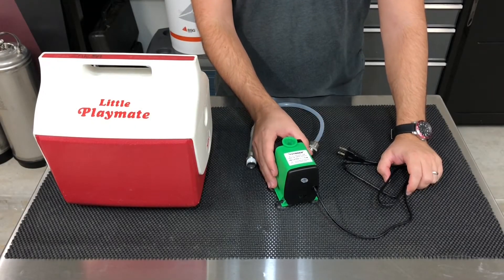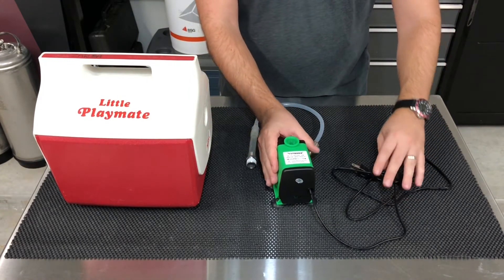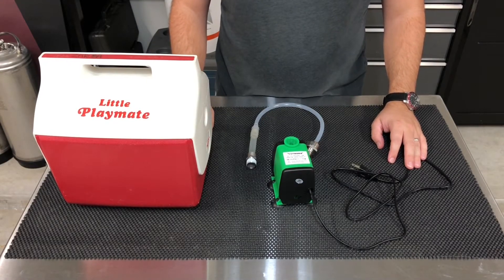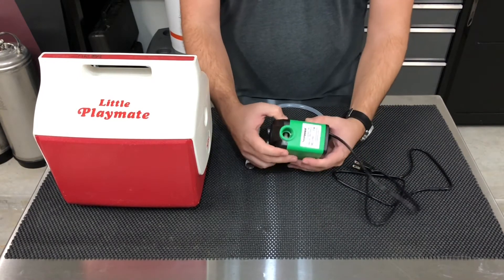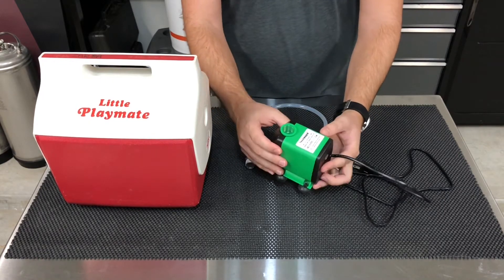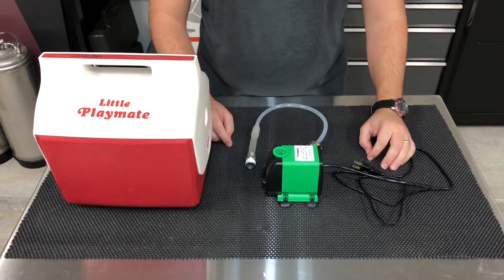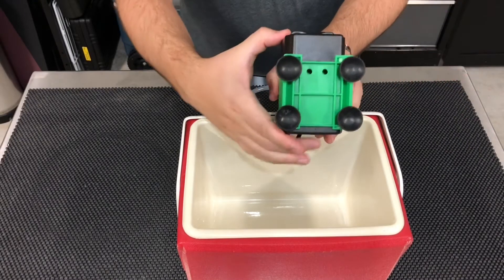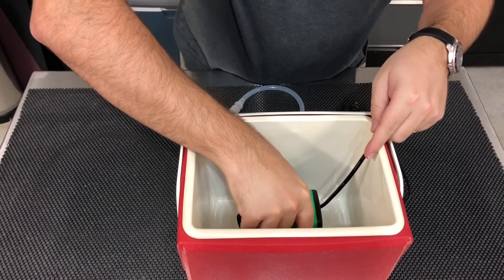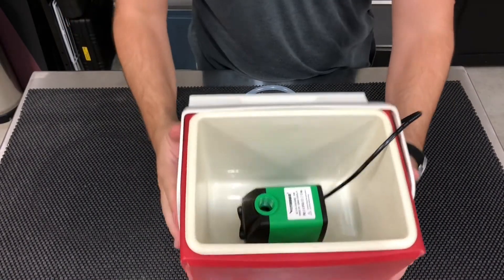So I just picked this VivoSun up off Amazon the other day — I think it was on their lightning deal for 18 bucks. This is a great little submersible pump that we can use to circulate our BLC cleaner. What's great about this is it has a half-inch NPT threaded port right here, and a lot of our fittings are already half-inch NPT, so it's a great conversion. It also has these little plunger feet so you can mount it into the bottom of any reservoir — your bucket, your cooler, whatever — and basically this guy's just going to stay put.